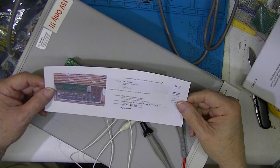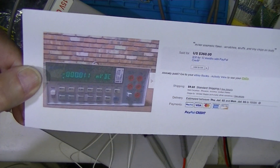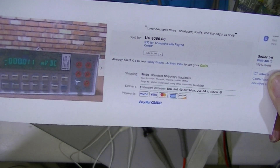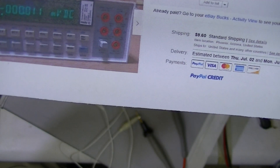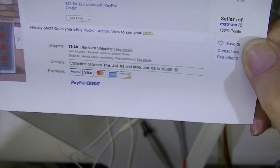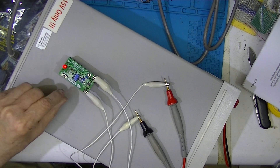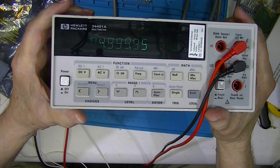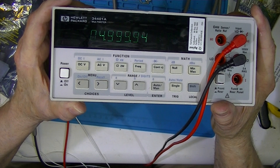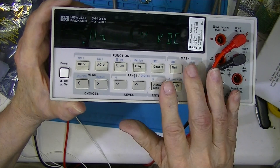I'm not going to wait much longer — it's been about 45 minutes. The meter is hooked up to the voltage reference that was calibrated to 5.00000 volts. And the meter reads 4.99995.